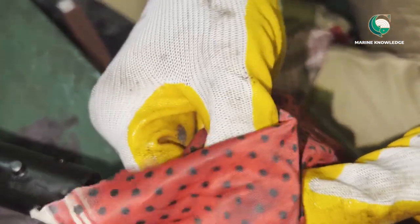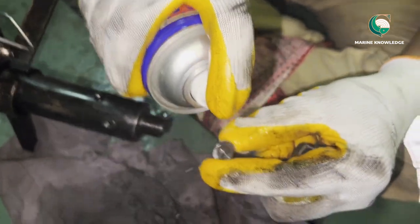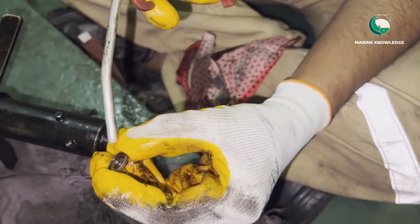That is the reason we can see — comparing with the Pilot Burner, the pilot nozzle is very clean, but this Main Burner nozzle is having a lot of carbon deposit. Here also you have to check the pathway. The reason why this main burner is working needs to be assessed.